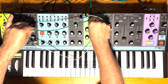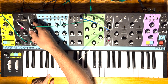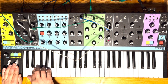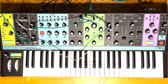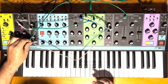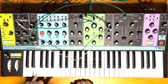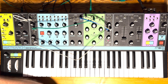There are a lot of options for modulation. One quick thought would be to modulate the cutoff of VCF2 with an LFO. We can also use the filter envelope generator to modulate the amount of wet and dry — just patch the envelope out into the attenuator. There are tons of options for this. I was just excited to see how easy it was to patch parallel filters. Thanks for watching.